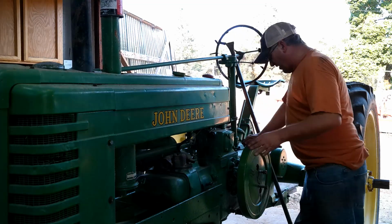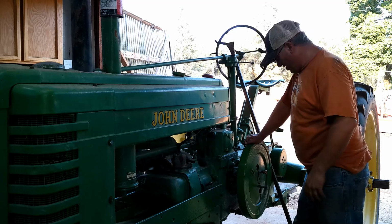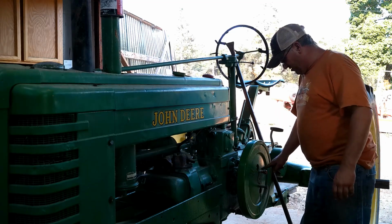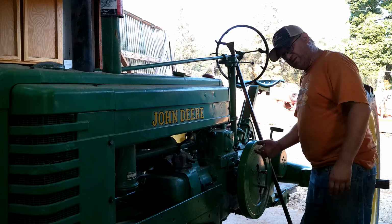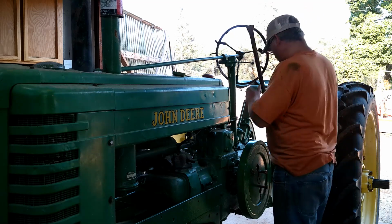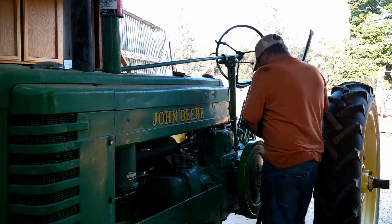Now, something that a lot of people don't know with these old tractors is in the flywheel there's actually 2 threads. And those threads can be used, if you thread bolts in, you can use them as a leverage point for when something like this happens. You put bolts in there, use a nice pry bar. Let's see if we can break this thing free.